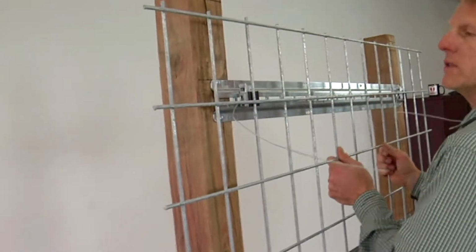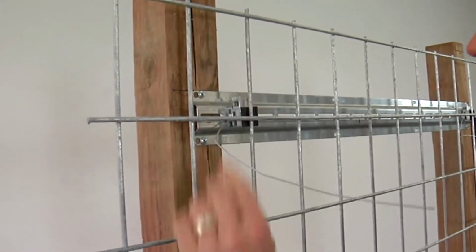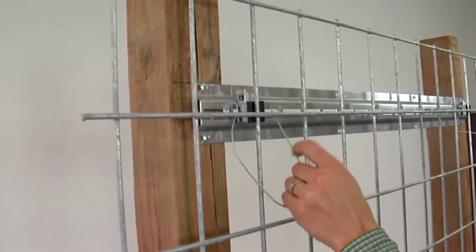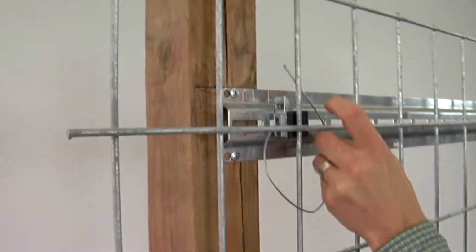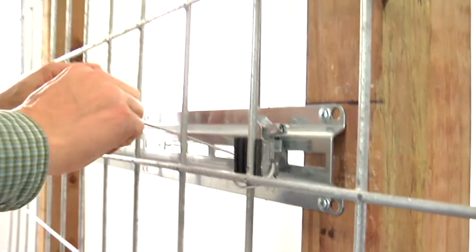We're going to set this up here and just press it into these gripple clips. They've got these nice rubber pads here. We want to support that weld junction right there. Once we've got it in position, we run the gripple cable through there and we pull the slack out. It all happens nicely without any tools.